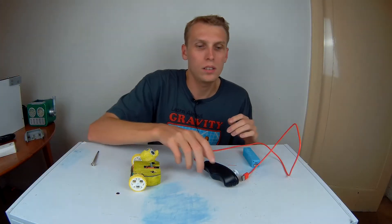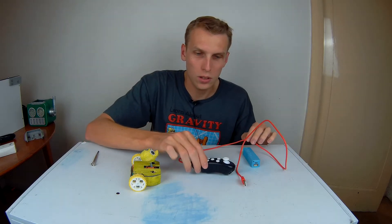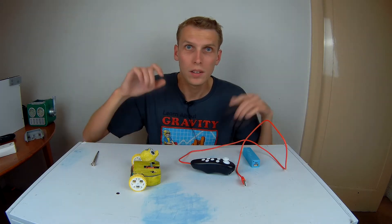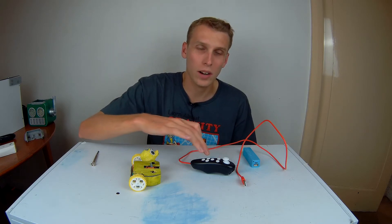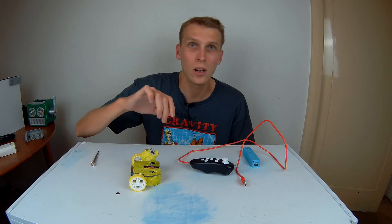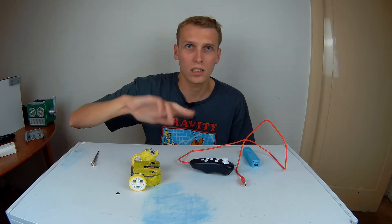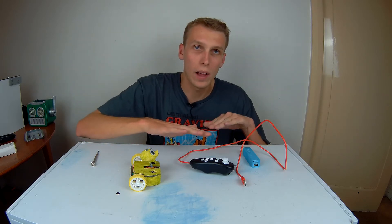The controller is now all set up. I've thrown some code into it — I'll put the code up on the Instructable which I'll link below. The values may need tweaking to get the stick to work correctly for your setup, because each individual build might be a little different in the positions of the stick compared to the value read into the Arduino. You may have to adjust some of the throttle position cutoff values, but you can look at all of that if you decide to go ahead and build one of these.